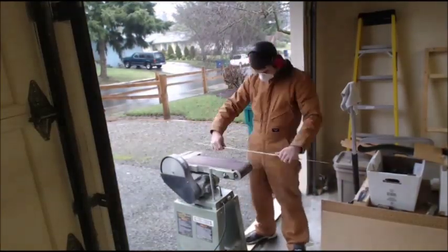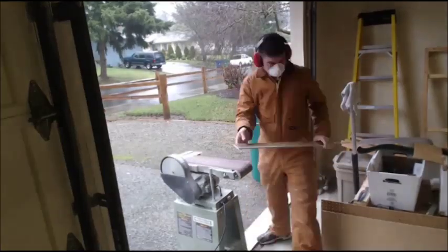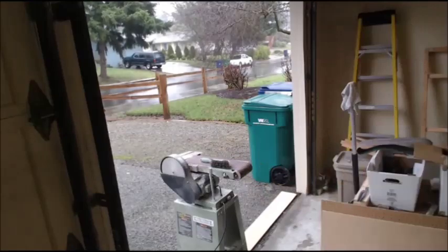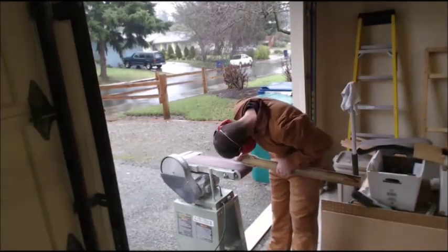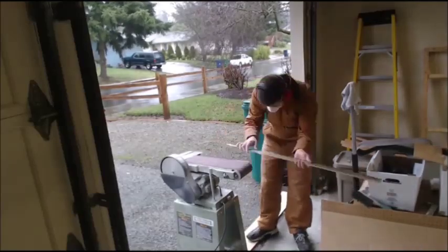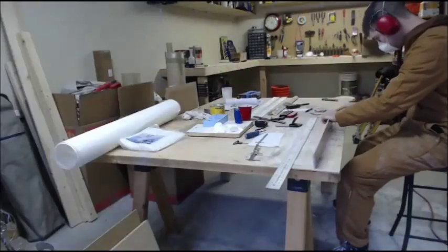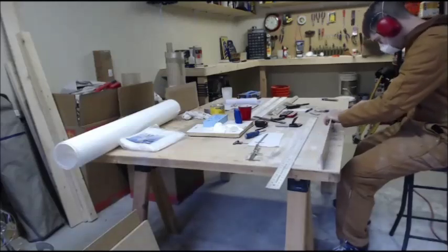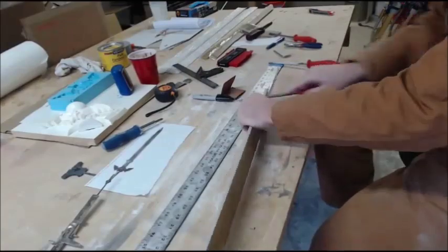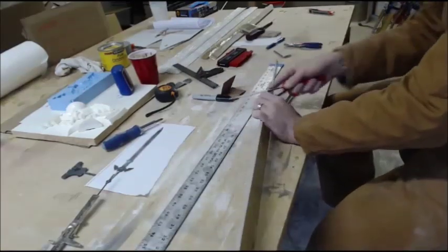This is my belt sander — a fantastic piece for working with a sword blank like this. Right now I'm removing all the extra material. I always like to sand to get down to the width that I need versus trying to cut the blade initially at the correct spot. I find that you end up getting walk and then you're going to ruin your sword blank. It's a pretty quick process and doesn't take very long with the belt sander. Very aggressive — I think I was using about an 80 grit belt on that one.